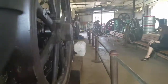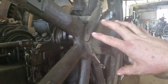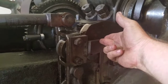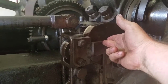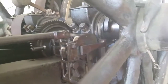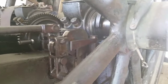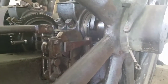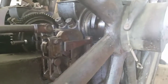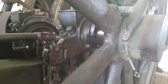After it fires, the flywheel turns faster, which makes the weights go back out. And as soon as it's going fast enough, that goes back over there, locks the exhaust valve open, and so it just coasts. When it's under no load, as you hear from other videos, it will only fire every few revolutions. If it's under heavy load, it'll fire every revolution. These are great because they use so little fuel when they don't actually have a load on them, which is why they can be run here for a long period of time.